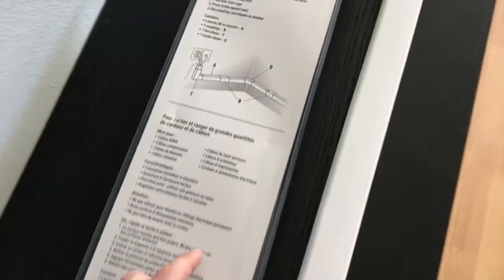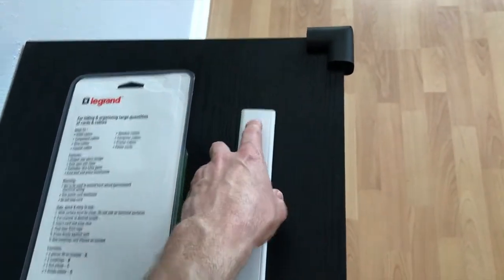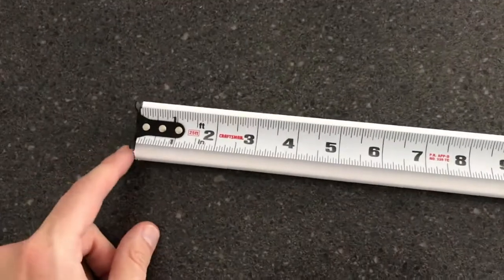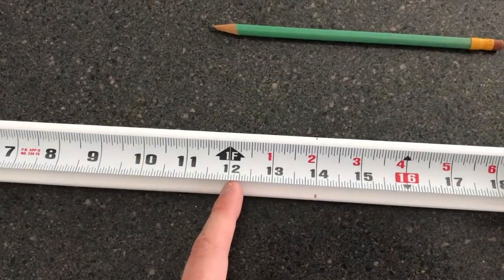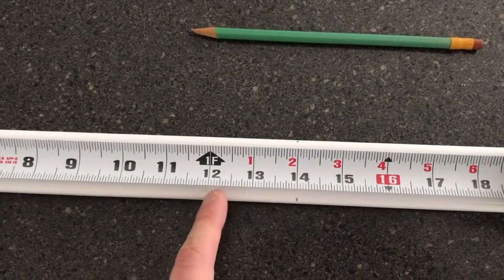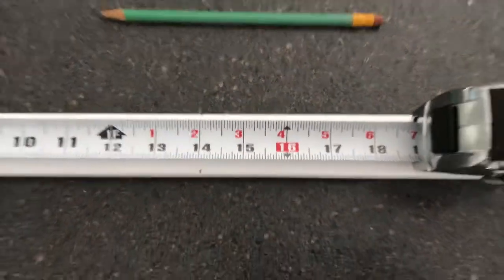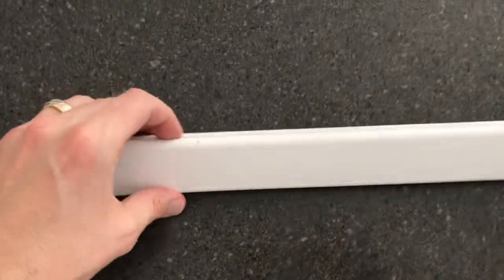What we need to do is cut about 14 inches, because we do not want the top portion to be visible — about two inches will go up behind the actual TV. The measurement from the top portion of our entertainment center to the bottom of the TV is 12 inches; we want two additional inches so we can't see the cords coming out the top as they connect to the TV. So, 14 inches total.